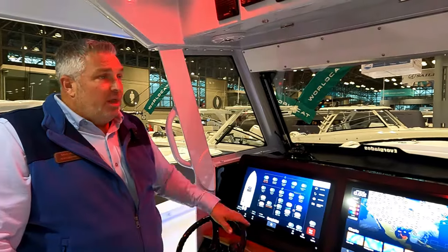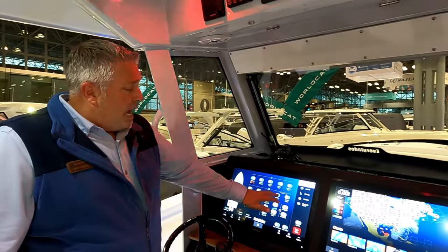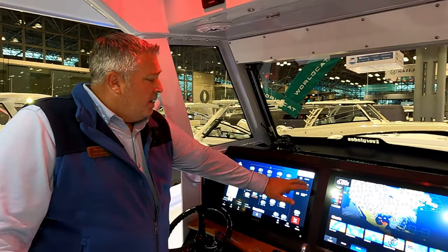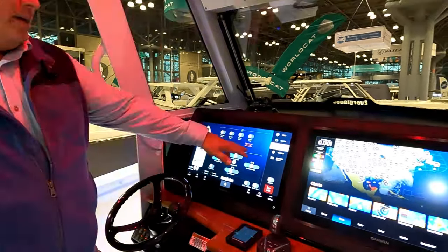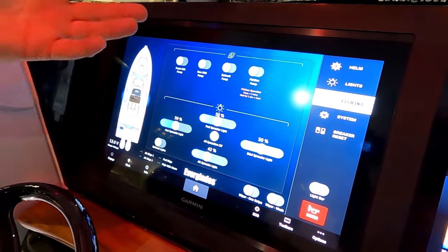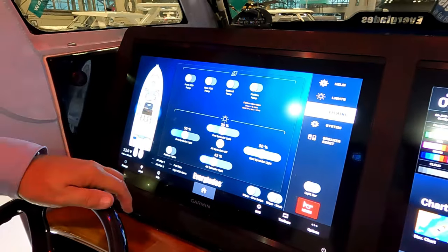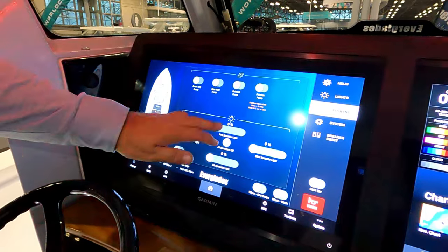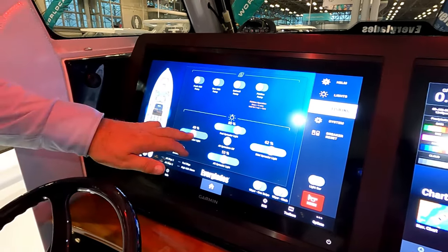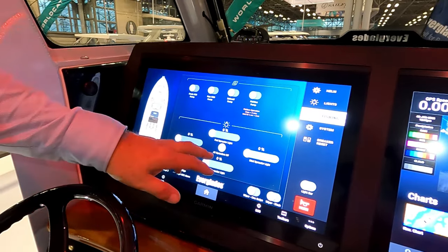On the Empire Bus system I can run all my lights, all my pumps. It's also a smart system — I can tap things on and it'll turn itself off, so I'm not leaving a pump running dry. In fishing mode, if I have a fish box pump, I can press it once and it'll run for five minutes, or hold it to run continuously. The spreader lights are individually controlled and on dimmers, so I can set them to a percentage and not blast my neighbor at night.